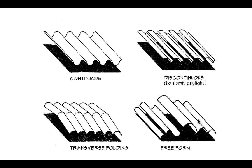Finally, most dramatically, we can do what's called free form. So long as every piece has some depth and some section modulus — deploying some of its volume at the top and some at the bottom, and finding a way to fix those two areas relative to one another — we can make it any shape we want.